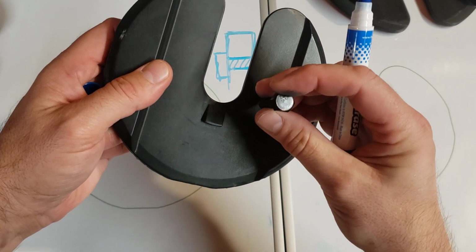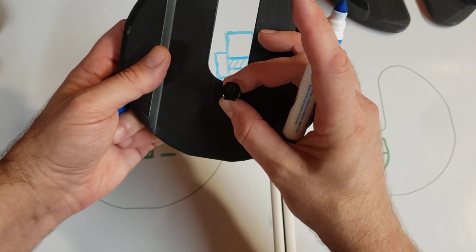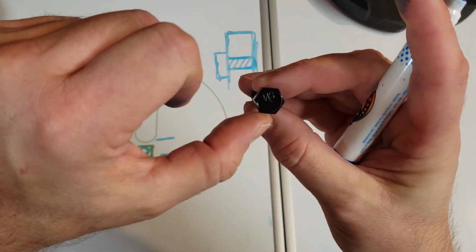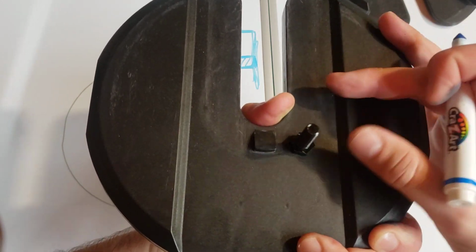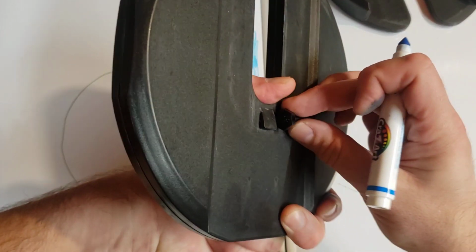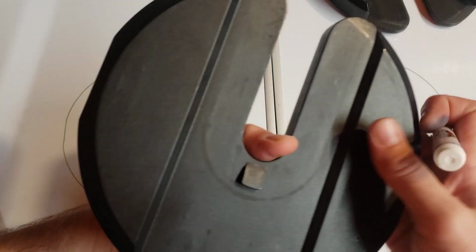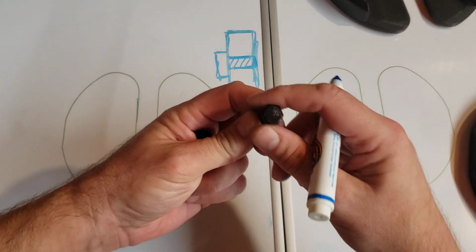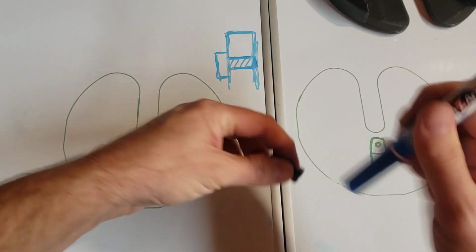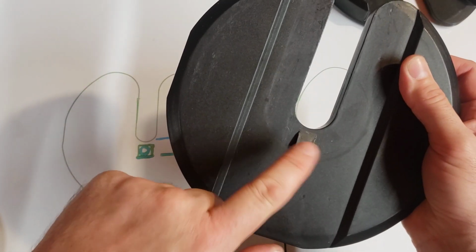And ultimately, what you'll end up with is a bolt that is fastened into your plate, and this now functions as the bottom of your tab. Same thing. This is going to be coming through your plate. And it functions as the bottom of your tab. So anyway, he drilled it, he tapped it, he installed a bolt, and now he's back in business. That bolt head functions perfectly as a replacement for his broken tab.